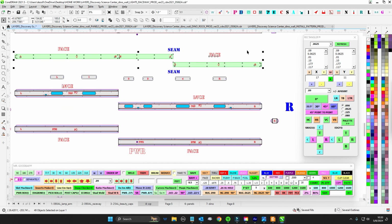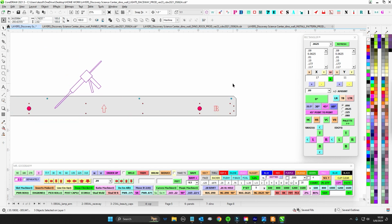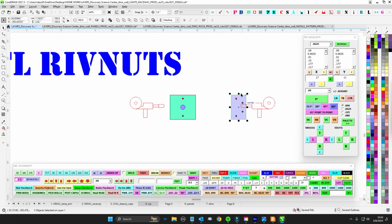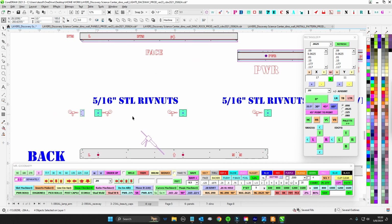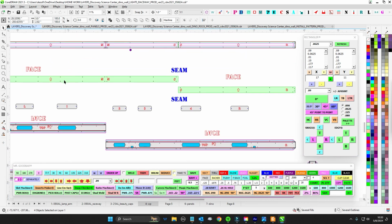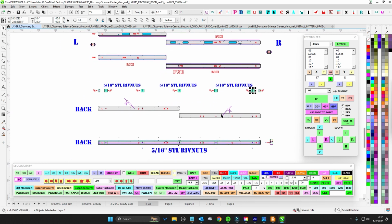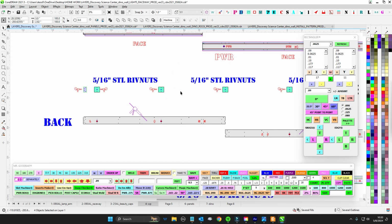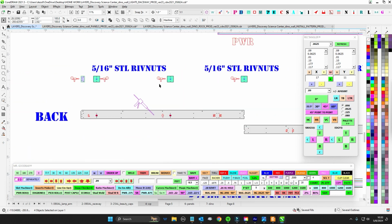And then on the back side, you're going to Cleco in the back corner just to help hold things together. You're going to tack that in. And then you have riv nut plates along the whole back side. So the front side is solid, no access. For the most part, you're not going to have any access inside this thing, but you're going to tack these from the outside in place. And then these will be where you put riv nuts.